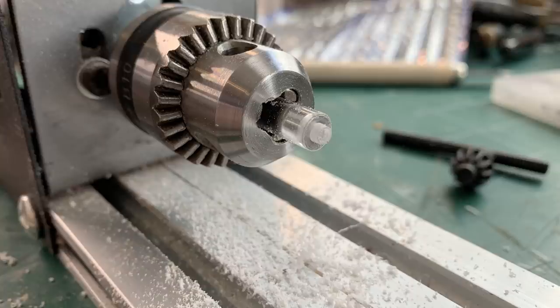I started by taking my clear acrylic rod, which is way too big for the project. And then I center drilled it. Using one of my sharp tools, I found the middle of the rod while it was spinning, which isn't too hard to do, and then shoved a drill bit just by hand up through the middle of that. And that bored out the middle of that large enough to hold one of those grain of rice bulbs, and then came in and carved down to the size of the tube that this needs to slide over. So it's a very thin section down there where the thing is going to slide over the brass tube.